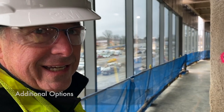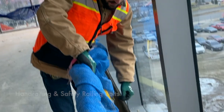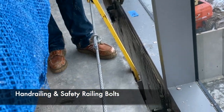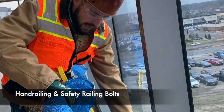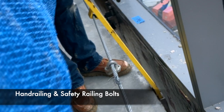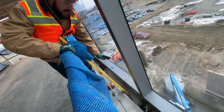It's real easy to uninstall the safety railing after the curtain wall is in place. The handrail brackets are bolted into the J-Edge system with T-bolts, just like the curtain wall connection is. The great thing about these brackets is they can stay while the curtain wall gets installed — they do not have to be removed until after the curtain wall is completely erected and closed.